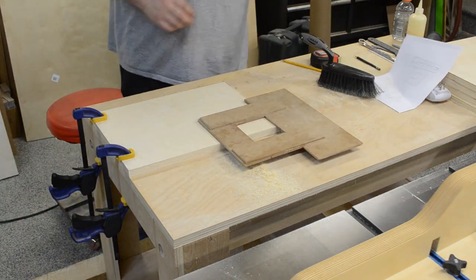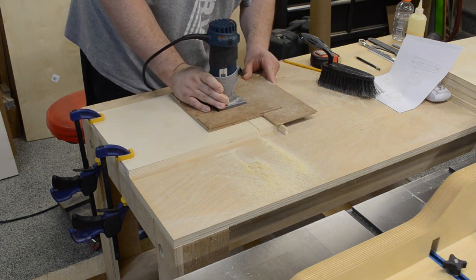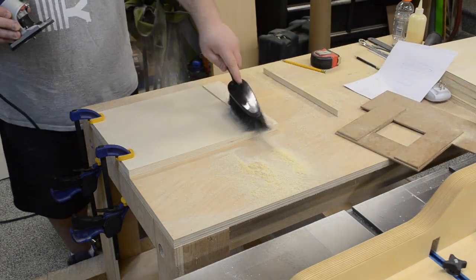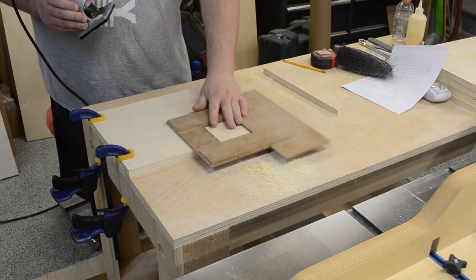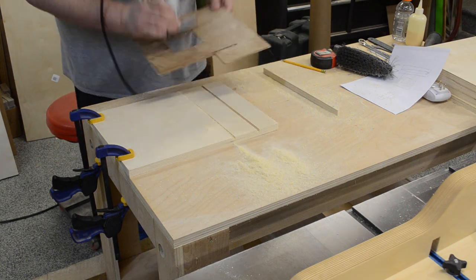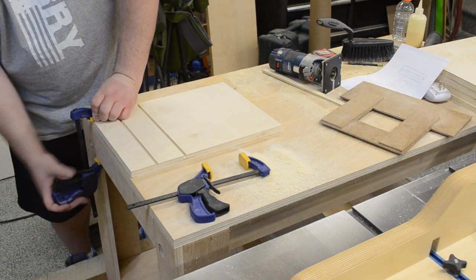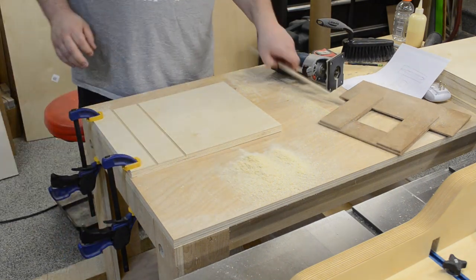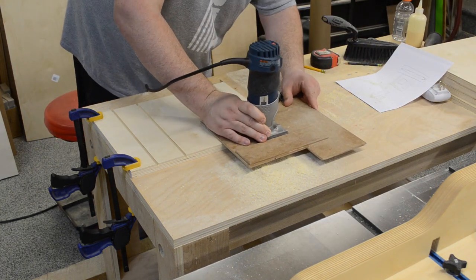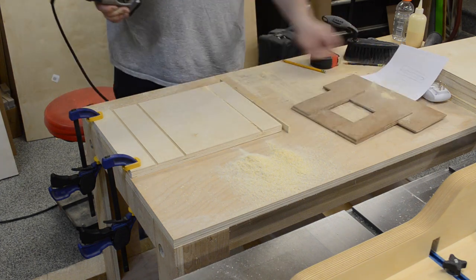My organizer was gonna house little plastic shoe box containers, and I wanted to have some dados in the middle dividers and also the ends so that I could slide in quarter-inch MDF pieces to act as dividers. I technically didn't need the first dado, but I used a spacer with my router jig and that gave me the perfect offset. When I cut my second cut, that's actually the groove or dado I was gonna use. Being that the first groove is there, it helped me set up the jig, and I could use it in case my needs change in the future.